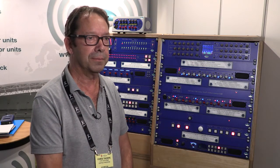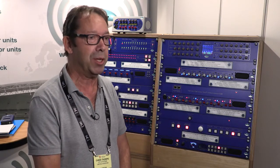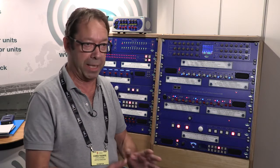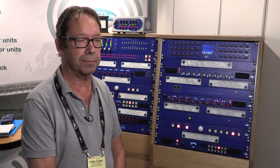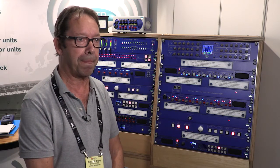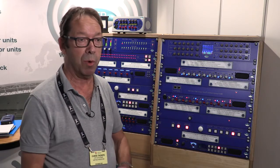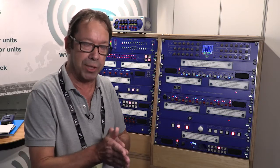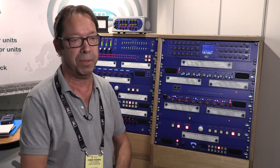And now it's all happening in a digital domain. It is, and it's getting more and more difficult to design, to be honest — very, very complicated. Now, of course, everything's software driven as well. It's a lot of pieces to put together to manufacture a product these days. I'm no longer designing tracks on boards for audio. When you're dealing with Dante and networking at one gig, the circuit board traces aren't carrying electricity anymore — they're carrying RF. They're waveguides, so the design rules are completely different.